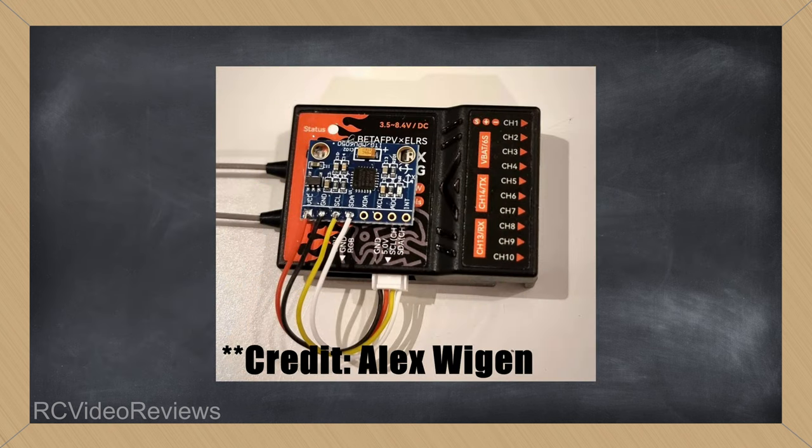There you go. Now I'm going to give credit to Alex Wiegen. I hope I didn't butcher that. Sorry, Alex, if I butchered your name, but here's the wiring diagram really quickly. And it's very simple. It's four wires. You need ground, positive, and then SCL and SDA, okay?